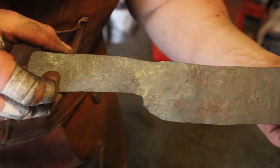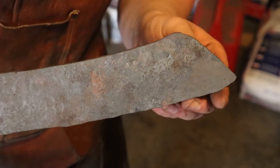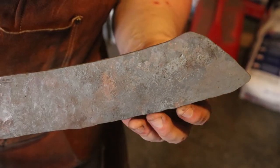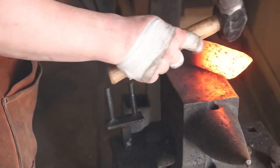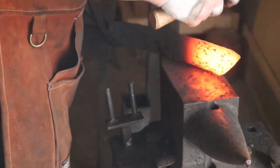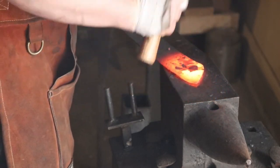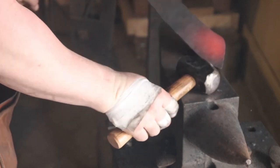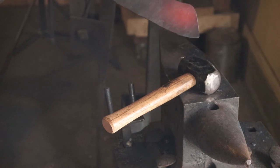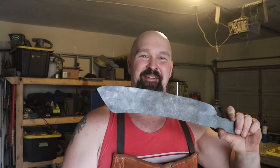Here it is — everything is almost ready for grinding. However, this belly isn't nearly as pronounced as I want it to be. I need to bring this corner back up, so I'm going to heat up the tip, pound it down, and try to flatten everything out again. I'm going to forge it over the edge of the anvil because I just want to bend it, not forge the material into itself. Actually, if I just forge this down some more I'll get a little more banana effect out of it — that'll probably do the trick. This is going to be one mean looking kitchen knife when I'm done; it would make a hell of a chopper as it is.